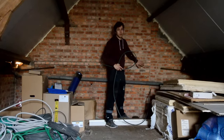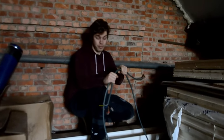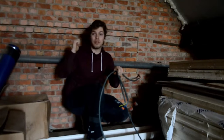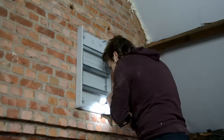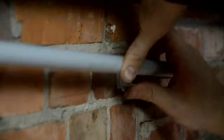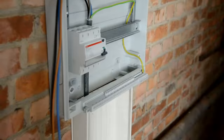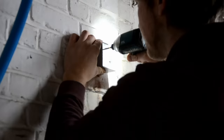The power cable is coming in through the wall on the first floor, and I want to place the fuse box right there. That way I can run all the cables along the ceiling all the way to the back of the shed without anything getting in the way. I'm hanging the empty fuse box on the wall and adding a large cable tray underneath to collect all the cables in one spot. I'll put every cable in a PVC sleeve just for protection. I'm connecting the main fuse and ground rail where all the fuses will be connected to later. Starting with the lights, I'm marking and mounting all the positions of the light switches so I know where the cables will go.